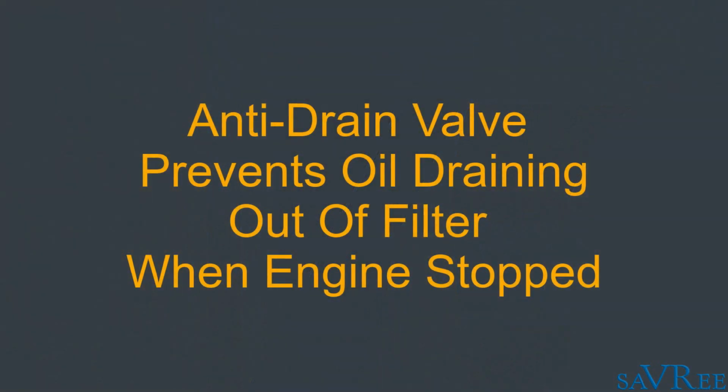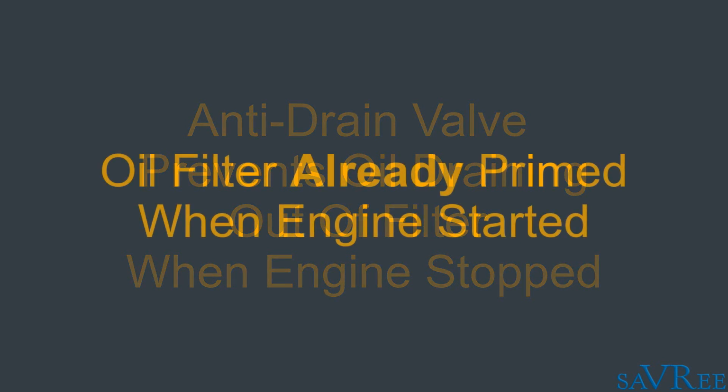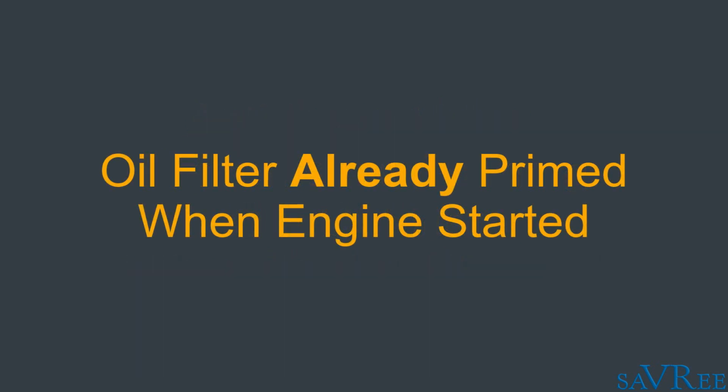The anti-drain valve actually stops the oil from exiting the filter when the oil pump is switched off. So in other words, if we shut down the engine, the tendency is that the oil, due to gravity, is going to all accumulate in the oil sump at the bottom of the engine. However, with the anti-drain valve, what we can actually do is seal the oil in the filter, and that means that the oil filter is going to be charged or full of oil, and that means when we start the engine we're going to have a supply of oil already.